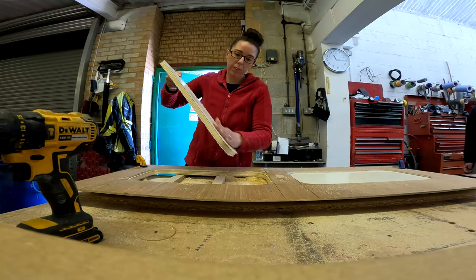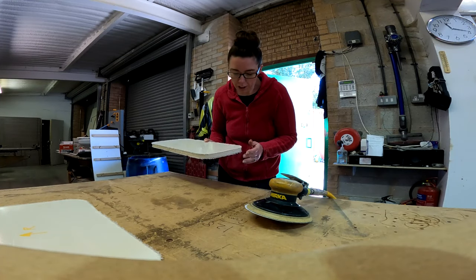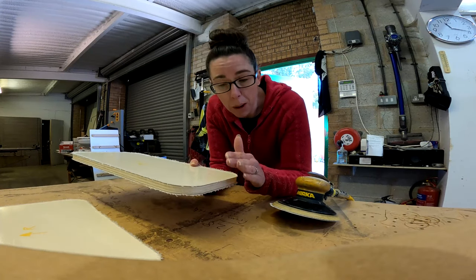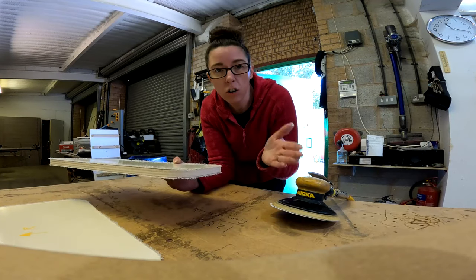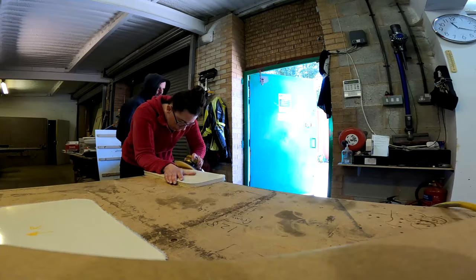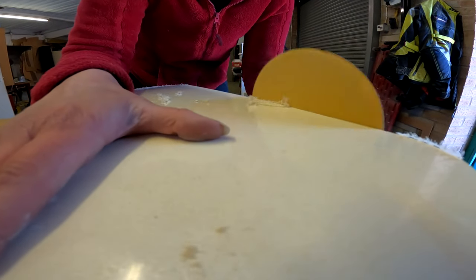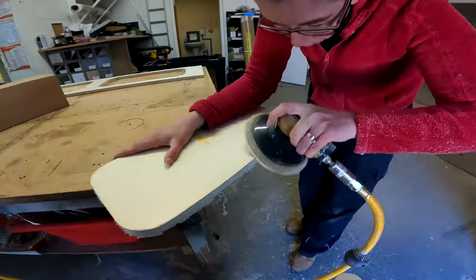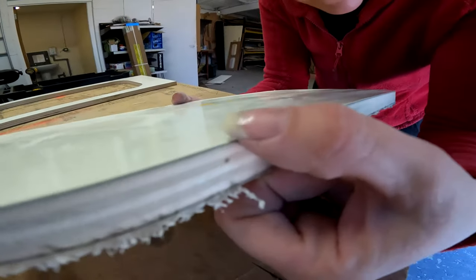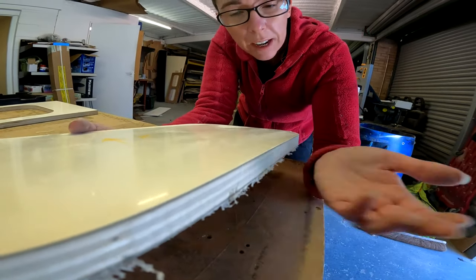We can now take these out, sand them up, trim them, and then they are doors. We're going to sand all the edges to make it perfect, and then when using T-trim on the side of the lippers, we put a gentle, very small 45-degree edge on it. That way, when you're knocking your T-trim on, it doesn't chip any of the decorative coating on your wood. We've put that slight 45-degree angle on to help knock the T-trim on — now we'll route it up, put the groove in it, and then put our T-trim on.